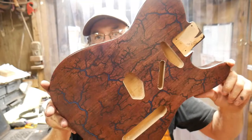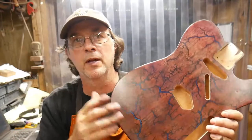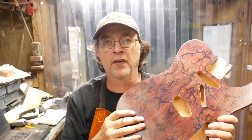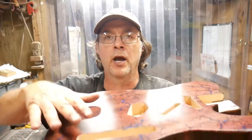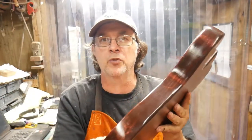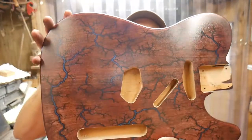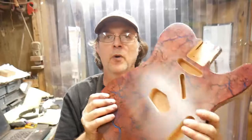Well, it's done — check it out. I think that looks really, really good. If you notice, the fractures are now turquoise. I happened to find some turquoise pigment that I forgot I had. Once I did that and everything dried, I went over the top with a layer of clear epoxy just to smooth everything out and make it nice and level. I went ahead and stained the back and the sides with black cherry stain, then coated it with 10 coats of instrument lacquer. I still need to wet sand it and polish it, but there it is — I think that looks really, really cool. If you want to see it put together and played, hit that like and subscribe button, come on back and check it out. Hope y'all have a good day!